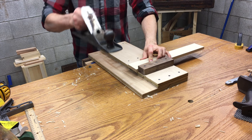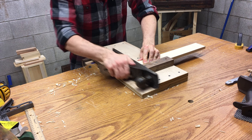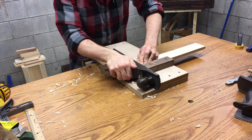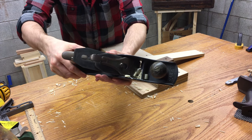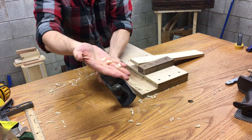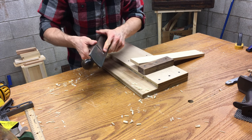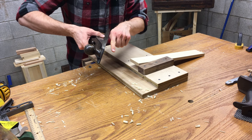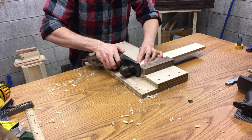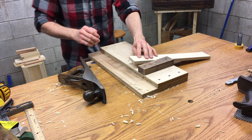Let me give you a final angle here to see this at work. Once again, I'm just going to run the shooting board — feeding it ever so slightly — and I am getting awesome shavings. I've got shavings there, and some that have come out on the board. One thing to mention: you don't want to have your plane iron sticking way out from the bottom. You want it really, really shallow — you want to take shallow slices, shallow cuts on that end grain. If you are too aggressive with the iron, it's just going to chunk and chip.